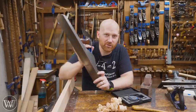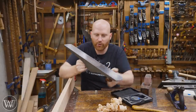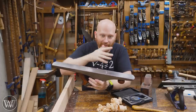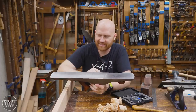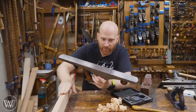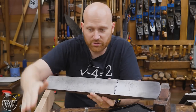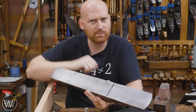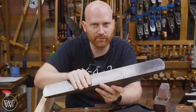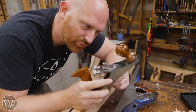When I want to clean off the surface and really detail it, I come in with my smoother. If you were to actually measure this sole from heel to toe, I would have a variance of about a hundredth of an inch — and I know most people say that's too much. Honestly, it doesn't matter as long as the tool is doing the job it's supposed to and producing the result it's supposed to. Every now and then I do get a plane that doesn't do what it's supposed to — I can't get a flat surface, or I'm having to put more pressure in — and in that case I'll check it for flat.